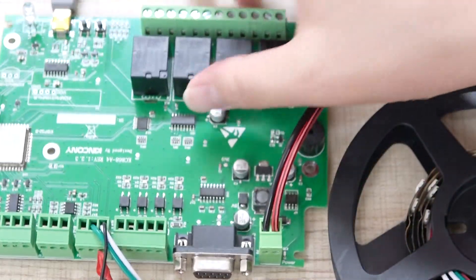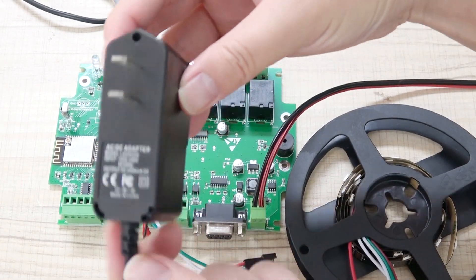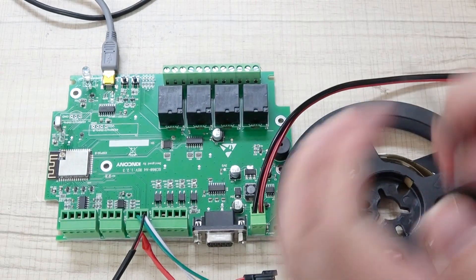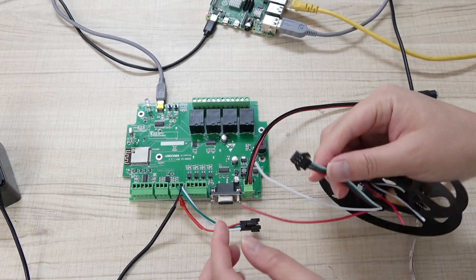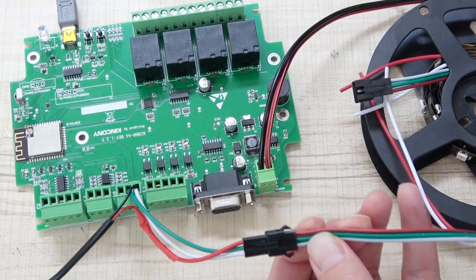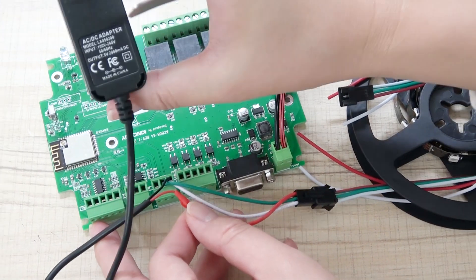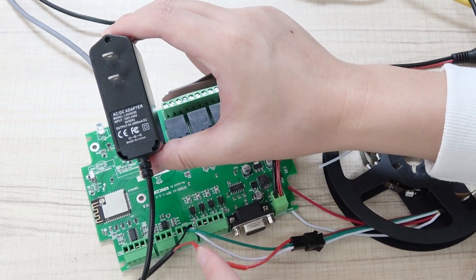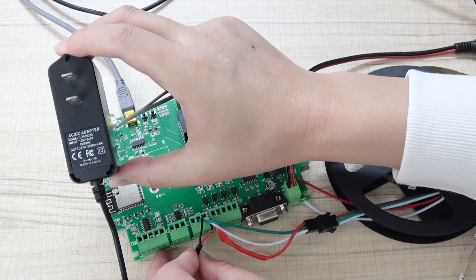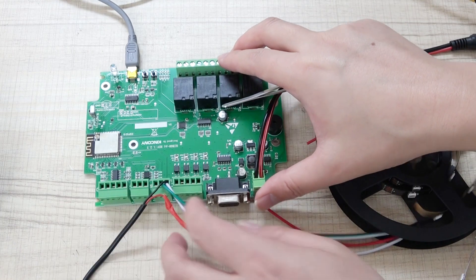Because this LED strip needs a large power supply, I've used an external power supply for the LED strip. I'll tell you later how to choose the right power supply. The red wire (5V) goes from the LED strip to the 5V of the external power supply, and the black is ground from the power supply. That ground is connected to the white wire of the LED strip — so this is the power supply for the LED strip, connected along with the signal from the A4 board.